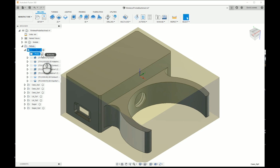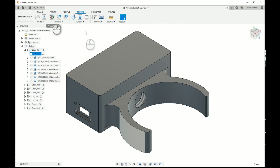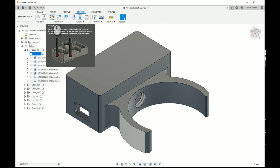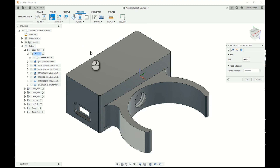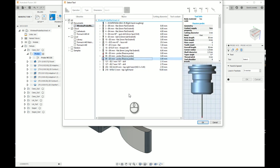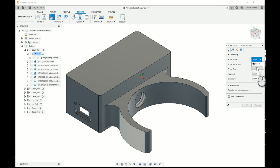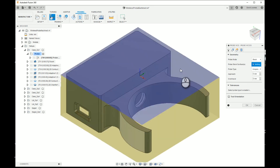I've created a folder here to hold the probing operations, just for this demo purpose. The probing operations are on the probing tab and the WCS probe operation is always available in all licensed variants. What I have to do is select the tool - for me it's tool 99. It's worth mentioning that the three millimetre diameter there is the nominal probe diameter, not the ultra accurate corrected one that's needed on the controller itself. Three millimetres is just fine for Fusion, and the only thing we have to do is say we are probing the stock and it's the top surface of the stock.